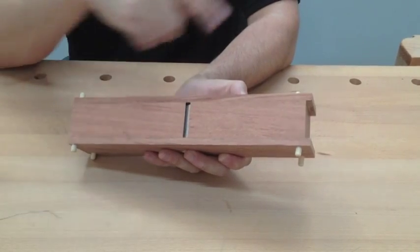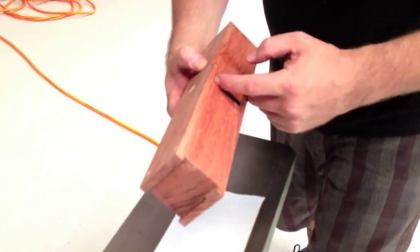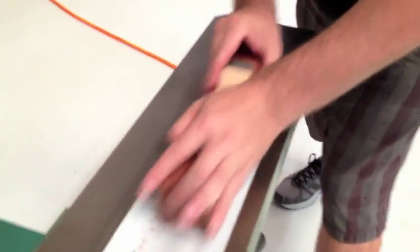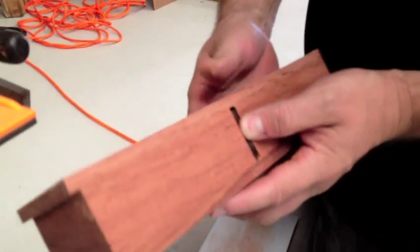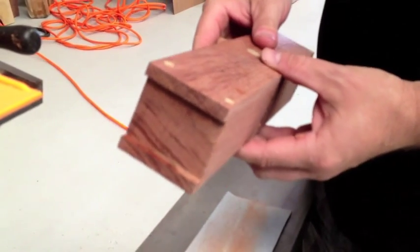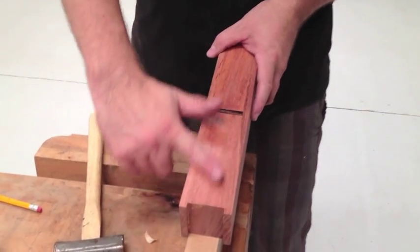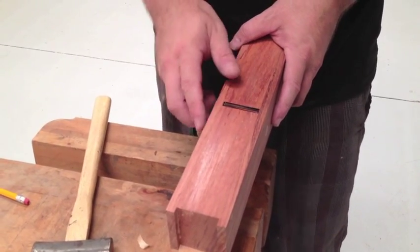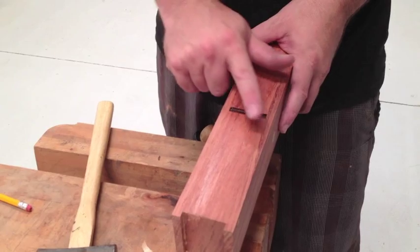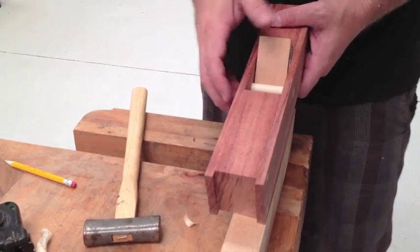Other than that, it's basically sanding it down and then we'll take it to final shape. With the blade and wedge raised up above, we're going to sand down, just keep checking where we're coming through. I think we're almost there — a few more passes and we'll go for it. After we get the plain bottom smoothed down, we just want a little bit of a hairline crack for that blade to poke through — barely anything there, you can just feel it. You knock the wedge in and that's how you firm it.